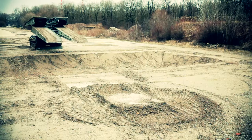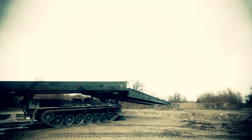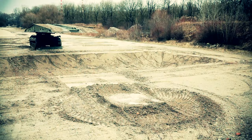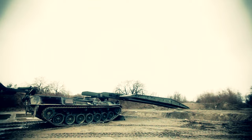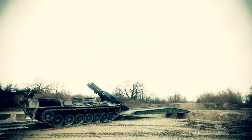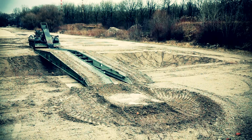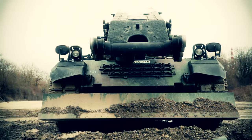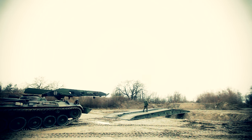The lower jaw of the beak extends and docks onto the upper jaw. A 22-metre-long bridge is created, which is pushed forward over the head of the tank. When the bridge makes contact with the ground, it can be detached from the lower section. The commander then inspects the bridge to make sure all connectors and bolts are in place. Only then is the bridge authorized for use.